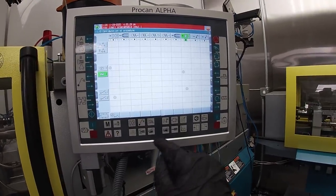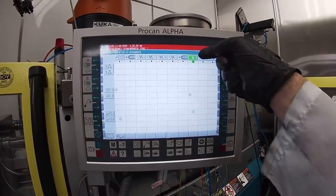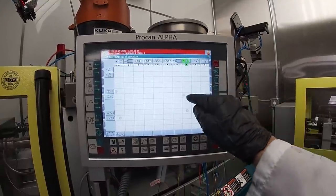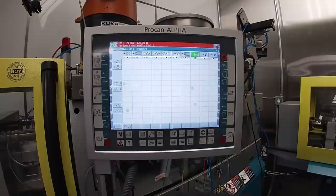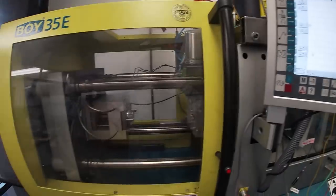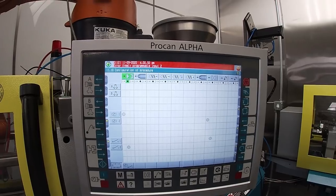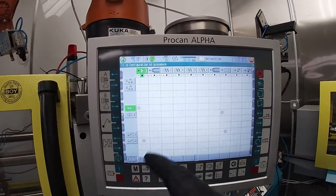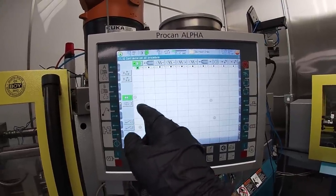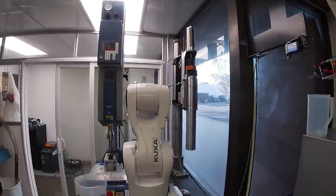Oh, actually we can go and check out the real-time map here. So you can see how the molding machine is waiting for the mold to open. So it's kind of frozen there and it's waiting for inputs. And I think these actually turn green when you see it, or maybe not. Yeah, so here on the programmable page, you can see now it's waiting to close. And there that switch happened, or the output happened when the molding machine is closing, which was sent to the Arduino. These guys do their thing again.